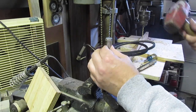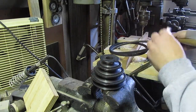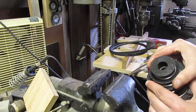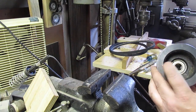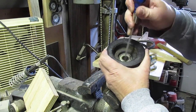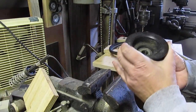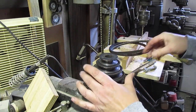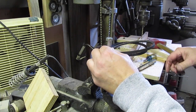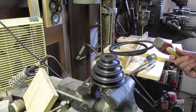And let's see how hard it is to take out. It's pretty tight. I might have to heat it because I don't think it's moving. I checked to make sure there wasn't a clip inside, because you can always get fouled up with that. I found out the hard way. So I could just heat the entire thing in an oven and make it expand, or I could put it in my hydraulic press over there and see how that works out. I was trying to do it so people even without a hydraulic press could do it.